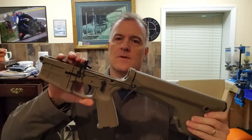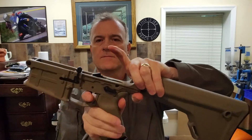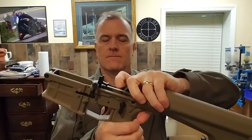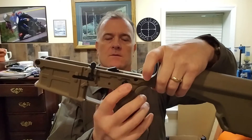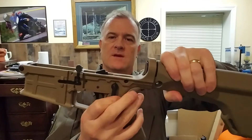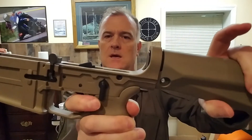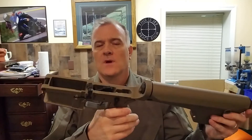Back on fire, I'm holding the trigger to the back to simulate the bolt carrier coming back — that's trigger reset. But in actuality, when this lower is married up with this upper, I think there's some hammer follow in it because the hammer is not resetting for follow-up shots in a semi-automatic rifle. That's my issue with this one.